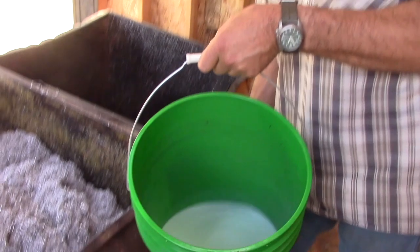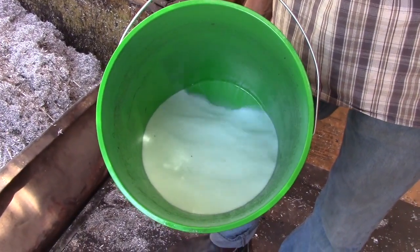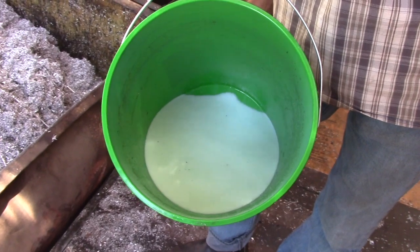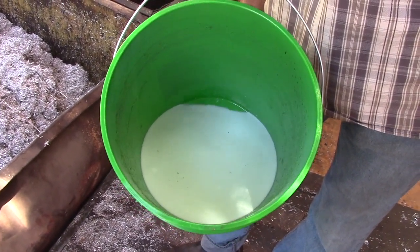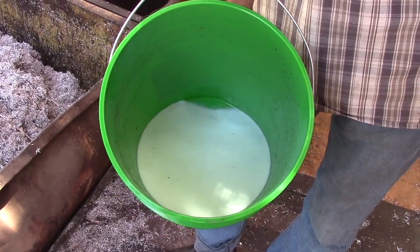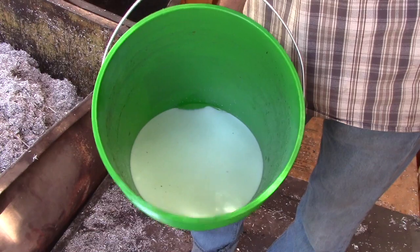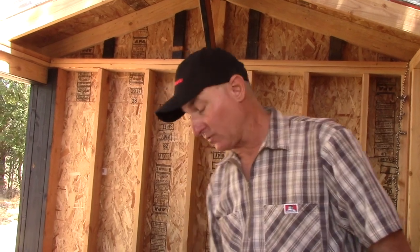This is what's called water-soluble coolant. It's basically 5% oil and 95% water, but it's the kind of oil that mixes with water — it's specially formulated, it's chlorine-free, all kinds of good stuff. We buy it — the water obviously comes out of the tap, but the oil we buy comes in 55-gallon drums and they're not cheap.